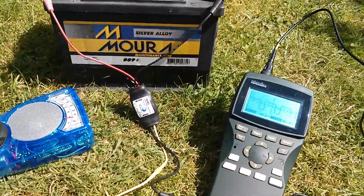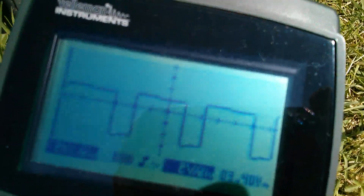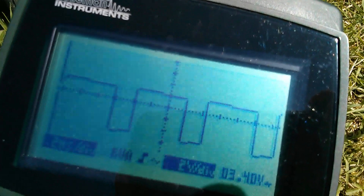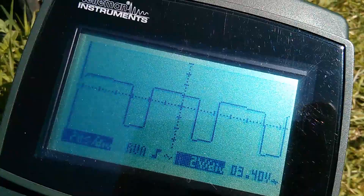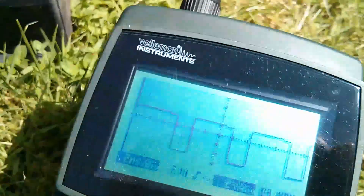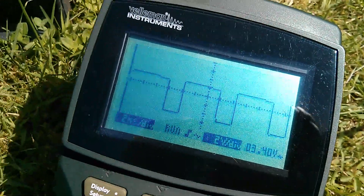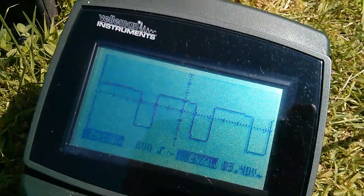For the sake of comparison, I've put the PWM5 in the same setup. We can see there's not much on and quite a lot of off. So the PWM5 is running at a lower voltage, and it's actually having to turn off more in order to keep that voltage more constant. The sun's pretty constant.